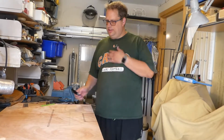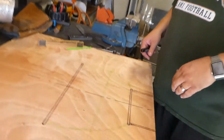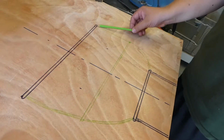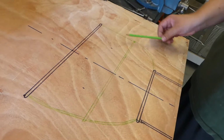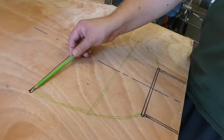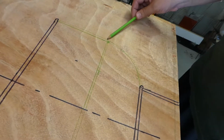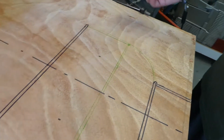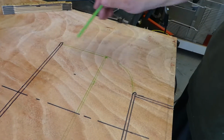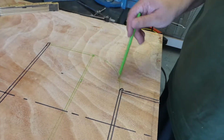So I decided to make a sketch on what I had available, big enough. I had a piece of plywood. This part here is what we already welded together. This is the 400mm ring, and this is the second ring. The question here is to go with a free-based curve like that, or making a bend that has a radius of 100mm and then go straight up. And for this project, my wife and I decided that we go for this one. So I'm gonna measure how long this is gonna be, because I could be quite short of material, and then make 2 identical rings and 4 pieces like this.